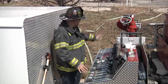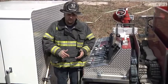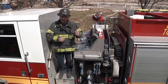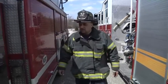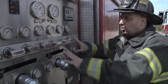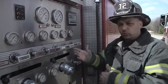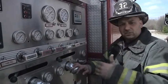The pump up here, it's a little bit easy to look at the hose outside. Now I'm going to walk down to your traditional side mount pump and we're just going to look at that and see if the line gets stretched off of the opposite side, how the firefighter can't even look without walking around the apparatus. When we come to this traditional side mounted pump, all of our gauges are on this side. If a line gets stretched off of the officer's side of the vehicle, we're not going to be able to determine if there's a break in that line — we would have to physically run around the apparatus and look to see if there's a problem with the line.